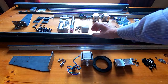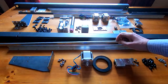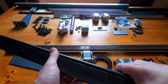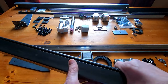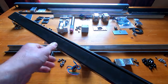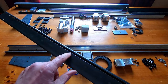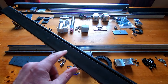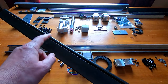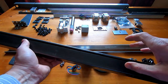The support is held in place with nine M4 bolts — I've drilled and tapped the holes in the main box section. The holes on the bottom hold the main rail in place. There's also a slot to allow the bottom part of the main support bracket to pass through. The blocks that run on the rail should be just slightly above the bottom edge of the slot so they move along without fouling on the top or bottom.